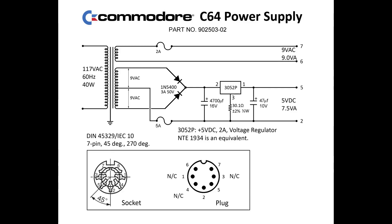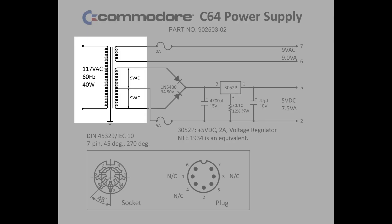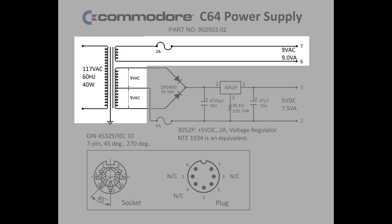Let's examine the design theory of a Commodore 64 power supply. The power supply is made up of a single transformer plugged into a standard 110 volt alternating current. This transformer provides a couple of taps — access to the transformer's windings — that provide various voltages transformed from the 110 volts AC feed. The first tap provides 9 volts to pins 6 and 7 on the Commodore 64 7-pin DIN plug. The current, just like the wall receptacle current coming to the transformer, is alternating current, or AC, and changes direction of flow back and forth rapidly on the two wires, thus its name alternating current.